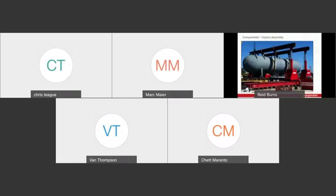And finally, we've got cribbing or matting. This is used because oftentimes when you're using a gantry arrangement, your supporting surface isn't dead level, and so you've got to use different shimming material to make sure that you're within tolerance, and we'll talk about that shortly.